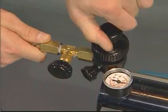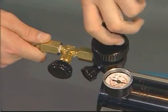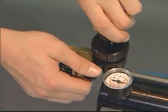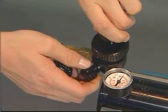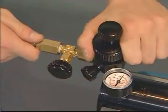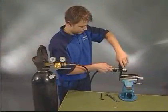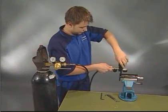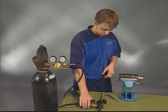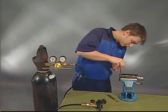Close the valve inside the gas spring by turning the smaller of the two knobs as far counter-clockwise as possible. Evacuate the pressure in the armature by opening the evacuation valve. The charging armature can now be safely disassembled. Affix the protective plug and tighten — it's important to do this as the protective plug has a sealing function.